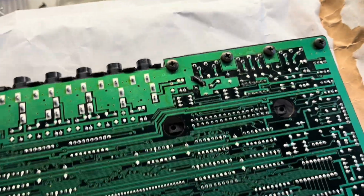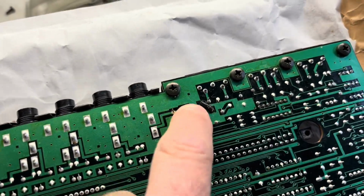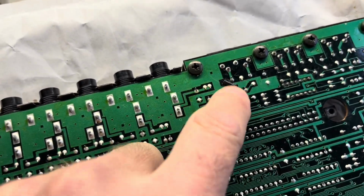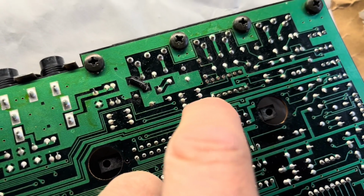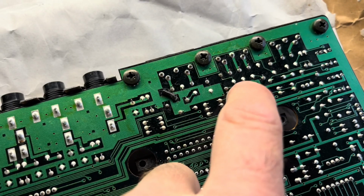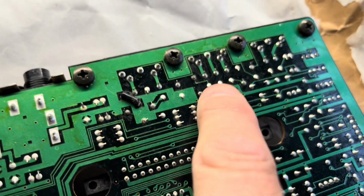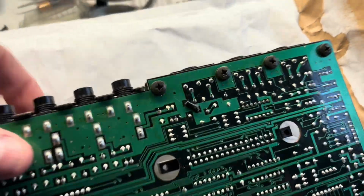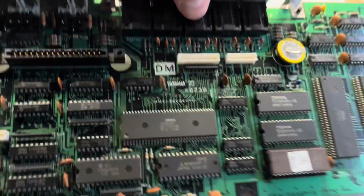So whilst finishing up on that battery job, notice there's this lump here, which is actually a leg of a resistor which somebody's put in, and also notice there was a bit of work here on that soldering on this IC, and some of that was a bit rough. I've just been around to reflow it just to make sure it's wetted through the hole there.